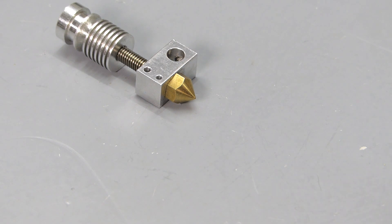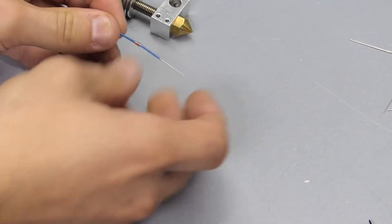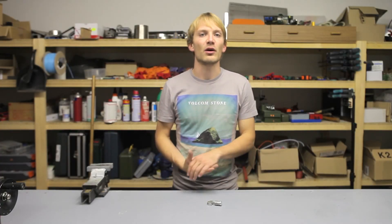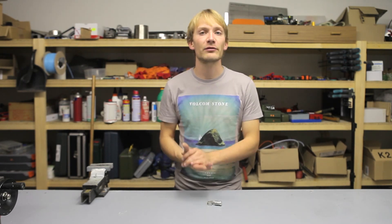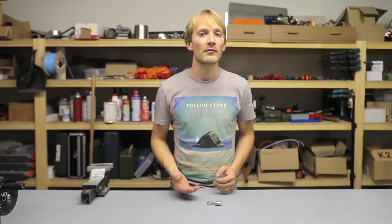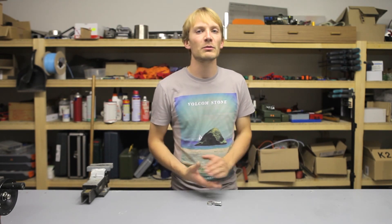Since I got the metal parts-only kit, I grabbed some glass fiber sleeving — you can also use PTFE sleeving — a thermistor, and a standard heater cartridge. Insulate the thermistor's legs, slide it in, bend it over, done. The heater cartridge is held in by a grub screw, and the hole for that is oversized by a good bit. This is meant to accommodate the cheaper heater cartridges, which can be oval or oversized — the 6.1mm bore on older E3Ds can have trouble fitting low-priced Chinese heater cartridges. The 6.5mm bore on the Alu Hotend seems like a bit too much though, as it means the heater cartridge makes pretty poor contact with the heater block overall. It won't cause any real issues, but it does mean heat-up times will be a bit longer than you'd expect.